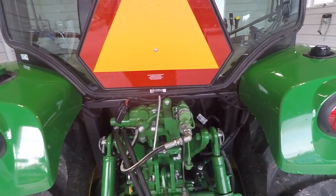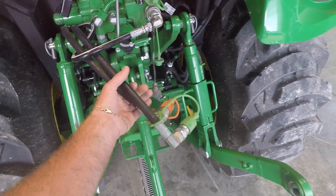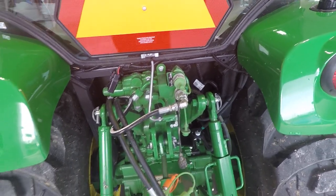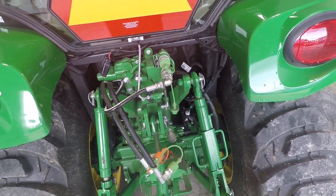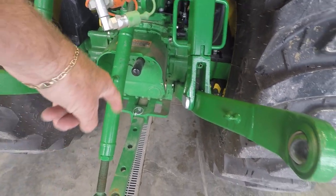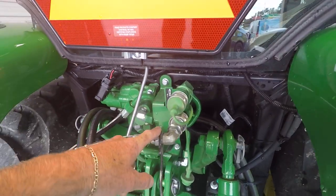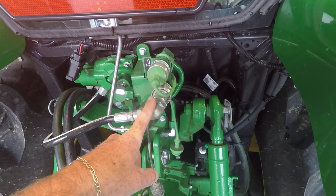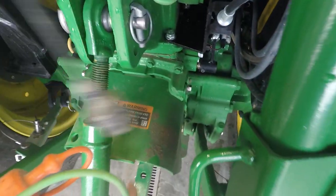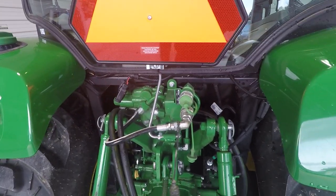So this is the rear takeoffs back here — pretty usual setup, except I had auxiliaries added. This is the group of hoses that would go up to power the front takeoff. You just pop this off, put these on, and then you're good to go — all controlled through the cab. Got your power takeoff down here, your hitch that you can adjust in and out, which I just recently found out does that — kind of a cool deal. When you do take these off, there's quite a bit of hydraulic fluid that comes out of the connection, so just be aware of that and have a rag handy. My Kubota didn't do that, but I think it's just a different setup.